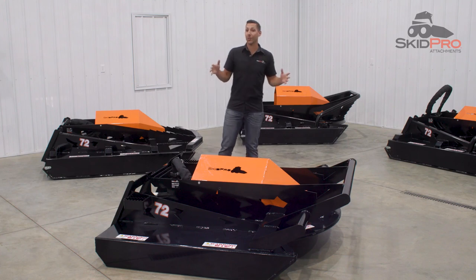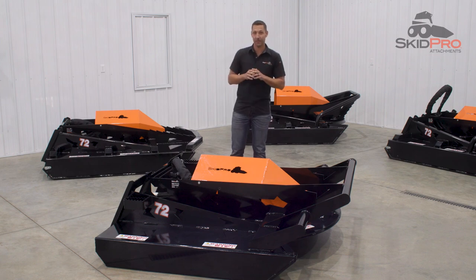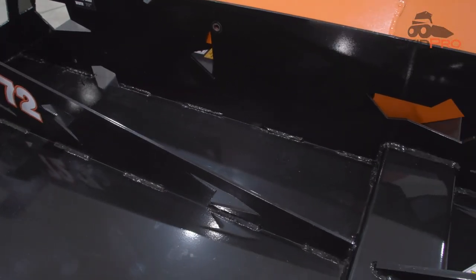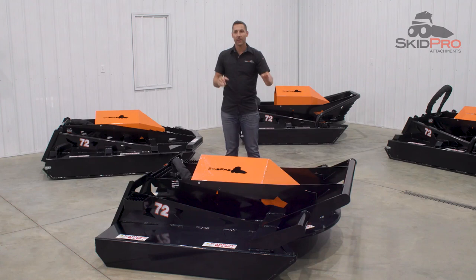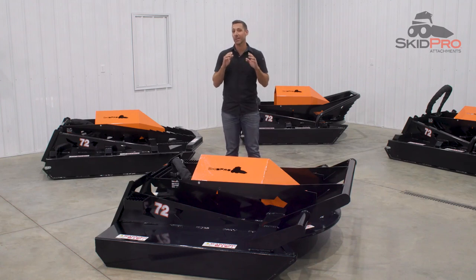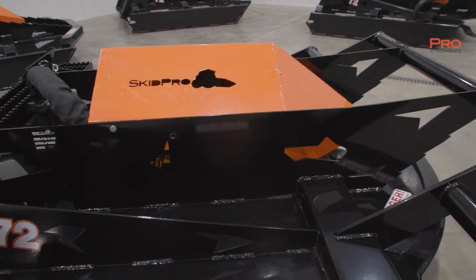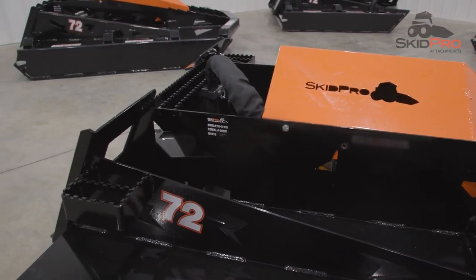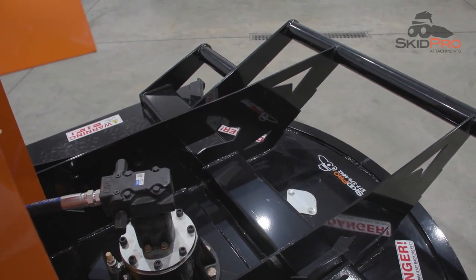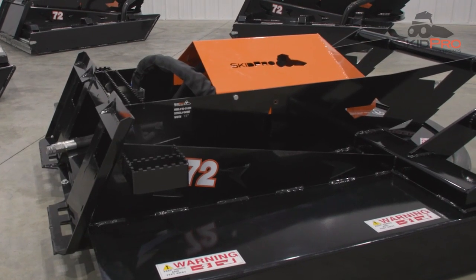Built with performance and durability as the goal, we know that nothing shows strength like steel, and lots of it. From our quarter-inch minimum decking to the vertical gussets to the half-inch front bumper, the HD3 is an absolute toad weighing in at 1,260 pounds. Adding to the rigid deck construction are the 12-inch tall vertical stiffeners running the entire length, and the 6-inch C-channel that connects the push bar and the vertical gussets. All of this locks together for lateral stiffness unrivaled in this class of cutters.